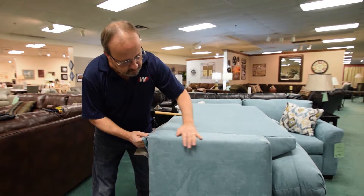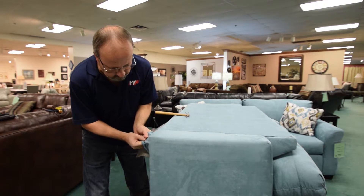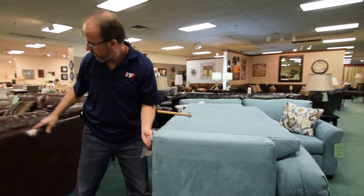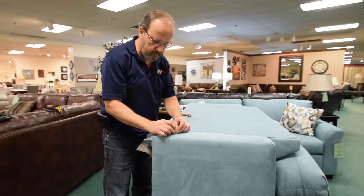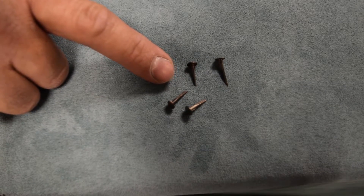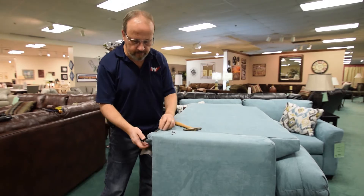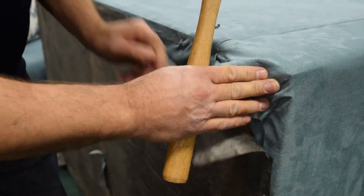Go ahead and stretch — sometimes using your hand to pull the fabric taut — and just hide that underneath. If you have access to a staple gun, you want to shoot in there to keep it tight. If not, these small tacks — a lot of people call them carpet tacks or blued tacks — you can pick these up at your corner hardware store and use them in place of staples, just tapping them in with a hammer.